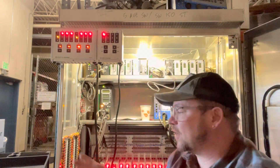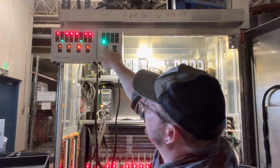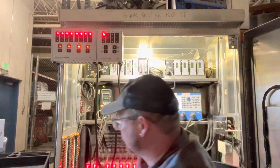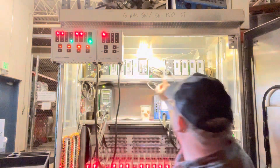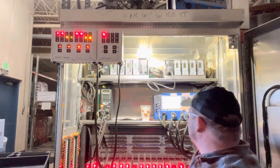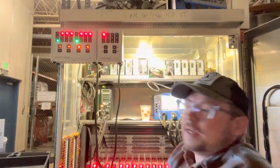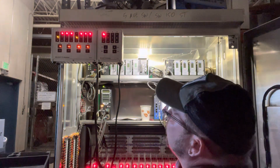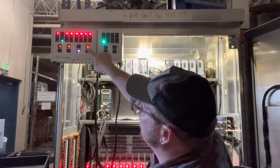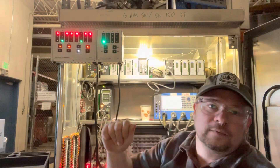If you're following me now, I've got my loop here. As you can see, they're all coming up at the same time and the ped's not active. But if I take my load switch and trigger my call, there's a delay going in right here. You can't hear the beep because I didn't set the beep, but now the call went in and locked in a ped call on my controller. And now after phases one and five are done serving — watch what happens. Nine came up, six walk came up, six just served. So it works.